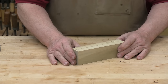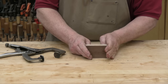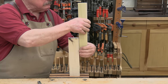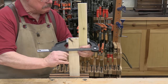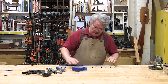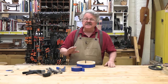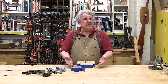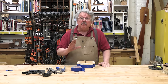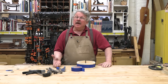The most common of these is the spring clamp — squeeze to open, release to apply pressure. Locking jaw clamps are C-clamps that operate like vice grip pliers; simply squeeze the handle to lock the jaws on the work. Quick grip clamps, or squeezy clamps, are bar clamps with a handle and a trigger that advances the jaw each time you squeeze the trigger. And don't forget tape — oftentimes these are just temporary, something to hold the parts in alignment until you can bring the screws in and apply serious pressure. But that doesn't mean they're not important — oftentimes these spell the difference between success and a complete mental breakdown.